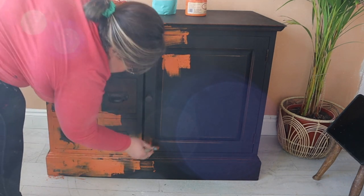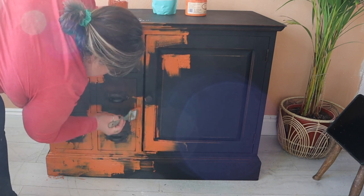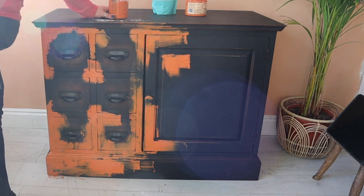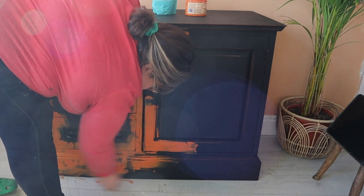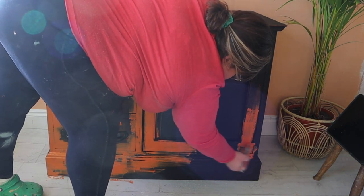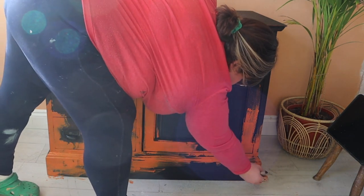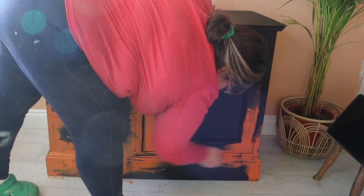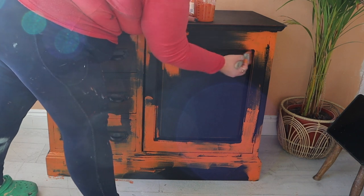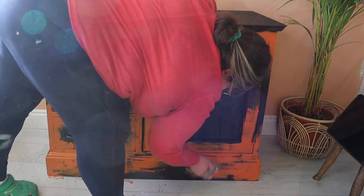What I'm doing with my very thick paint mixture is just applying it with a natural bristle brush — this is a premium chip brush from Dixie Belle — and this is going to give me lots and lots of texture that, when I distress back, will be visible through the green paint. I'm concentrating it in the areas where I want to see orange, especially around the bottom, and also thickly on some of the door edges and drawer edges as well. Random application is the key for this kind of look — you want to apply your paint in some areas really thickly, in other areas a little bit thinner, and use a combination of brushing and stippling. You can also use a spatula if you want a really heavily applied textured base.